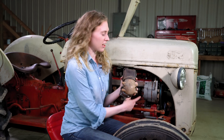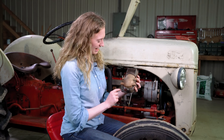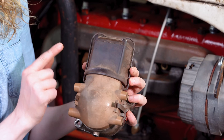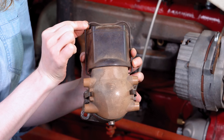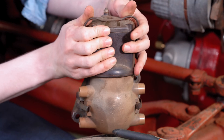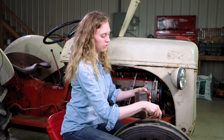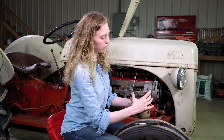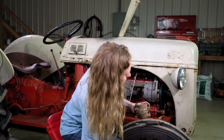The distributor is really tucked into the front of the tractor tight, so I want to tell you how to take it off — I'll demonstrate with this distributor off the tractor since you wouldn't be able to see a thing otherwise. There are two bolts — that's the easy part. The harder part is the coil and the cap. The coil is fastened onto the distributor with this bail, so you can just slide this bail forward. Sometimes spark plug wires have been zip-tied to the side of the bail — if that's the case, just clip them off so they're free. When you pull the bail forward, the coil will come off and you can fish it out of the tractor. It might be easiest to set it aside first and then fish it out after the distributor is out.